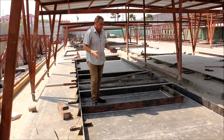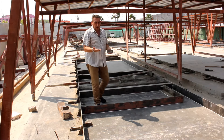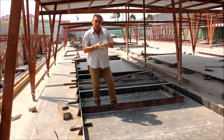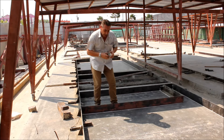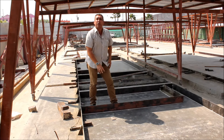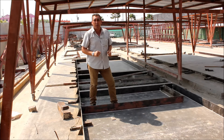I'm standing within what will be a door frame, so this is an opening that doesn't have any concrete go inside it. On the backside where we have an electric socket, we have small plates of steel which will be positioned exactly where the electric switch or socket comes, so once again that doesn't get concrete poured inside it.